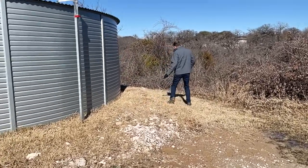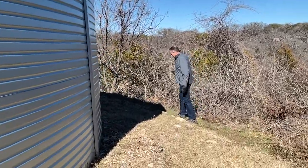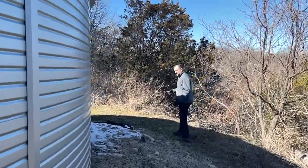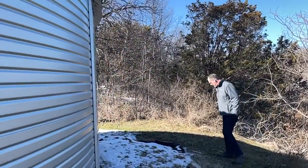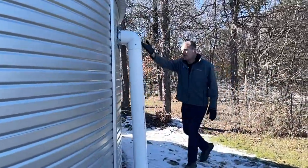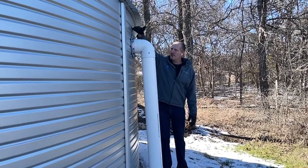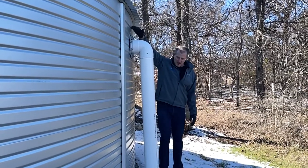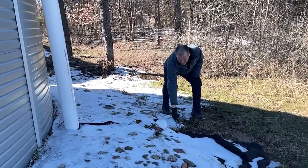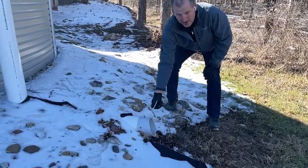Walking up to the back side of the tank here, you'll see what happens whenever a tank like this is full to capacity and the water has to go somewhere. So the Pioneer tank comes equipped with a 6-inch overflow. The overflow in this case comes out right here, and it has a bell mouth that sticks up about this high. So the water level on the tank is probably right about here, maybe just slightly higher. Then it spills out into this 90, comes out here. In this flapper valve, you can see the water coming out because the tank is full, and now will spill down the hill into the creek bed.